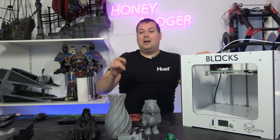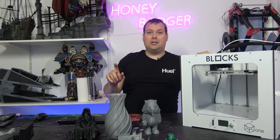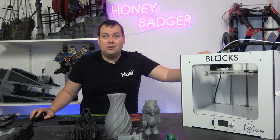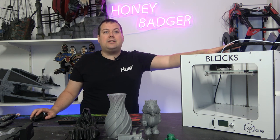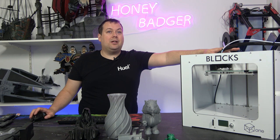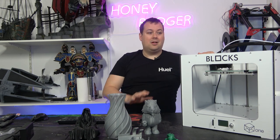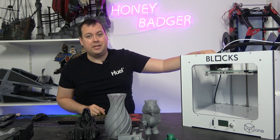I'm impressed with it, and I'm excited about the R21 because it's a different animal — way more like an Ultimaker. It has changeable cores, filament flow sensors, filament run-out sensors, RGB lights that can let you know when it's starting to struggle, a dual-drive direct gear all-metal extruder redesigned from the ground up, Wi-Fi built in, and an Octoprint Blox plug-in for immediate connection. The R21 is ticking a lot of boxes for me. This is just the previous version — it still has its place, but the R21 gets me excited about what it could do.